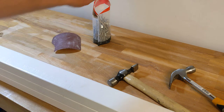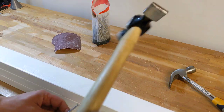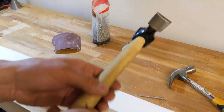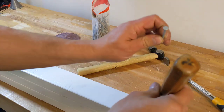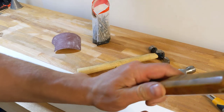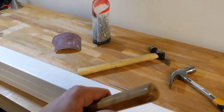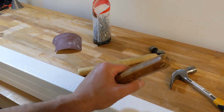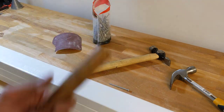The great thing about this for me is the top of a nail is quite small, and you need to hit it with a hammer consistently. That is such a good way to build up control for dealing with your chisels, because if you compare the size of a chisel with the size of a nail, you've got a hell of a lot more space to hit on there. And when you're using a chisel you're not looking at the end of it — you're looking at where you're working.